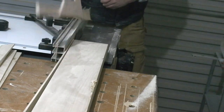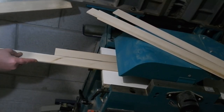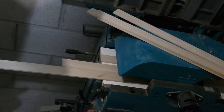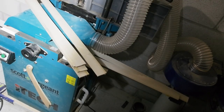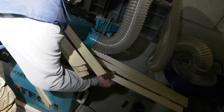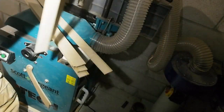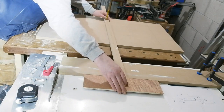I don't want it needing too much force to take the curve, otherwise there'll be too much spring back when released from the form. My rips are done at 5 millimetre, which seem to take the curve easily, so once planed to 4 millimetre they'll take the curve no problem. I'm showing this before building the form because although I have an overall final thickness in mind, I want to check the actual final thickness once all pieces are milled — how it looks and flexes — before committing to a form. It's also worth cutting a couple of extra rips.